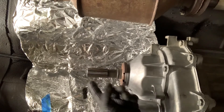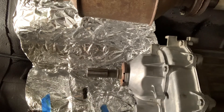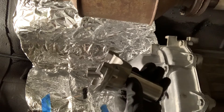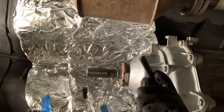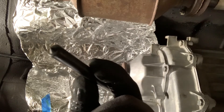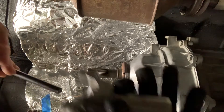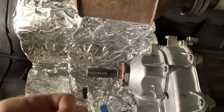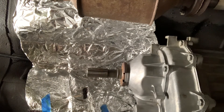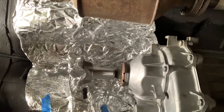So we did our hack and tap. I've chamfered the edge, cleaned up the face — it's nice and smooth. I picked the grease out of the splines and everything. Now I'm going to get ready to drill the center hole. I lost my jig for drilling, so I'm going to use this to mark it. I have a transfer punch, and it's just the perfect size to go inside of the actual yoke here — nice and tight. So I put the yoke up, put the transfer punch in, then use that to mark where I need to drill. That went right up nicely.